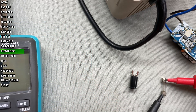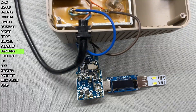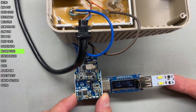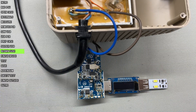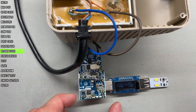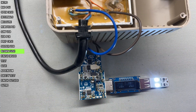As I don't have another one of that value I'll put in a new 100 milliamps one because I want to first see if it blows again. But no, it doesn't — after multiple attempts it's still holding. I know from the chicken farm that fuses that have seen a lot of use can degrade over the years and decades, so this might have been just such a case. Anyhow, I'll put in a new 200 milliamps one just to be on the safe side.